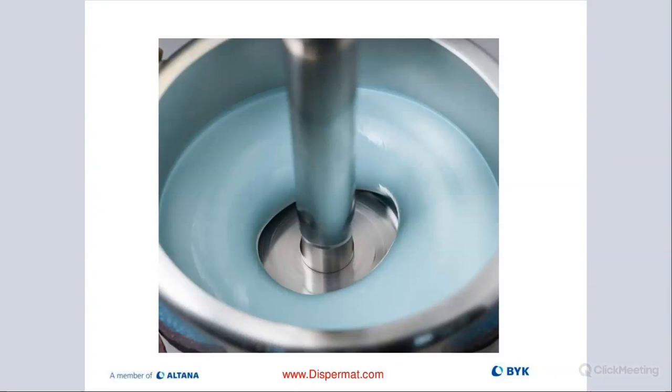Then we have something we covered last time more extensively. It's the donut effect. When we pre-disperse, really important, if I have the optimum viscosity and I'm putting in the right amount of energy, I should see the appearance of a donut being formed in my container. That's the visual cue that tells me I'm putting a good amount of energy in and the process looks all right, as long as I have 18 to 25 meters per second and viscosity in the optimum range, 2,000 to 5,000 centipoise.